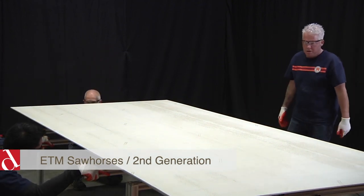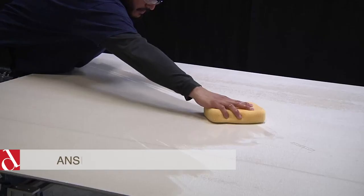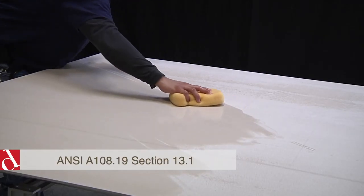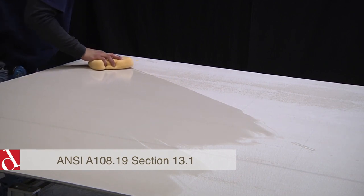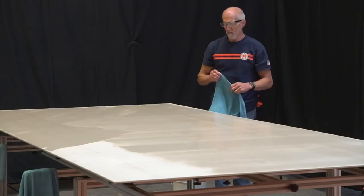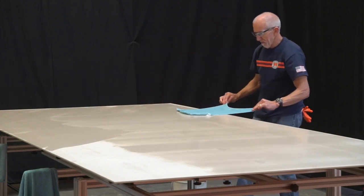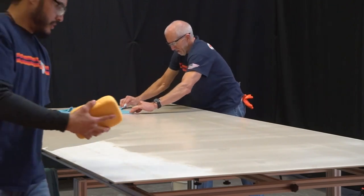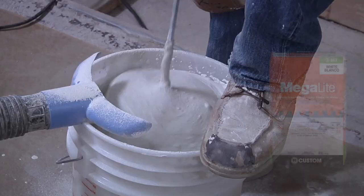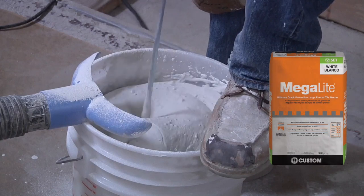The ETM saw horses are very wide so they sit perfectly on the rack. Clean the back of the panel with a damp sponge — this is also in compliance with section 13. To speed the process up you can use a microfiber to help remove any excess water from the back of the panel. This will assist in drying to keep things moving along.